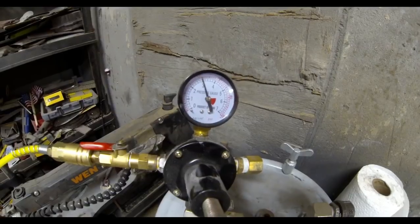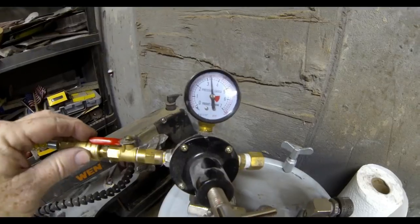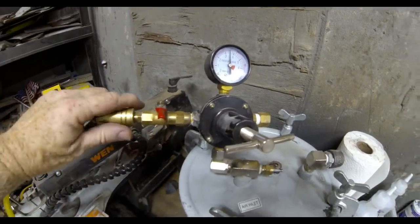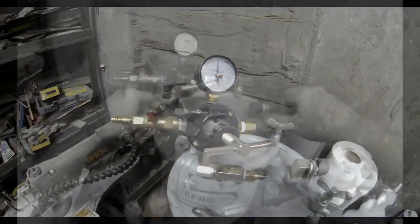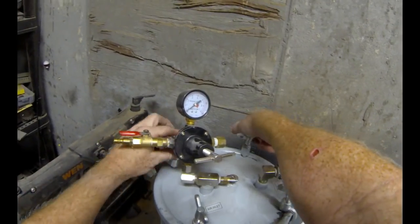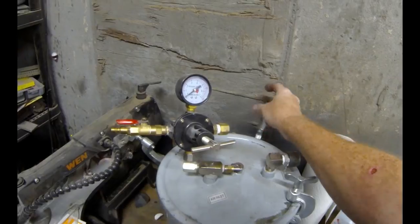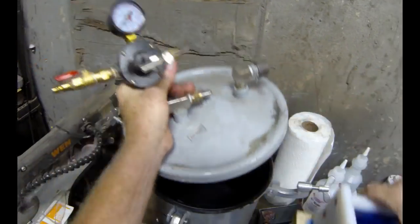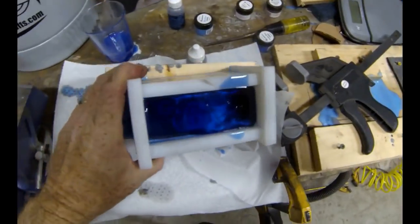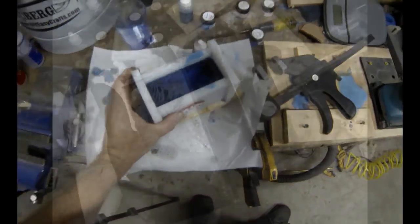Pressure's up to about 45 PSI, which increases the ambient pressure around the block and compresses the size of the bubbles within the mixture. For safety, I disconnect the compressor hose. When it's cured overnight or for at least four hours, release all of the pressure inside the tank before you attempt to remove the lid. And this is block number two — this one actually looks pretty cool as far as the color goes.